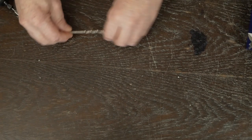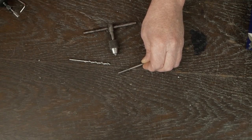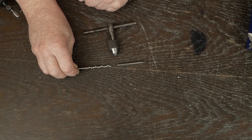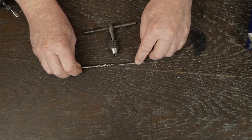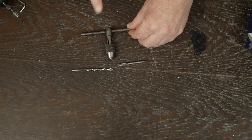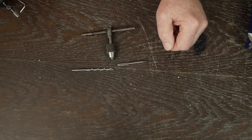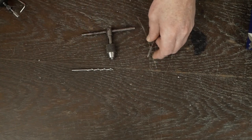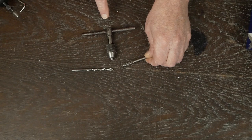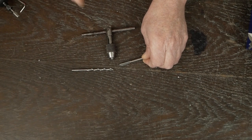For this project we're going to be drilling and tapping the mounting holes, so you want to get a 5mm 0.8 tap. The tap will come with a specific number drill — different from inch, decimal, or even metric drills — made to work with taps. You want the tap, the number drill, and then some sort of handle to turn the tap and keep it straight as you're threading the holes in the top of the chassis. If you're using a Hammond-type chassis with thinner metal, you won't need to drill and tap — you can just put longer screws with nuts on the inside.